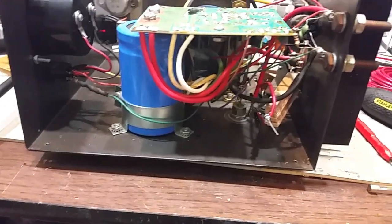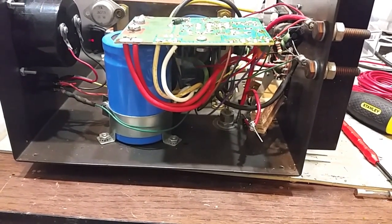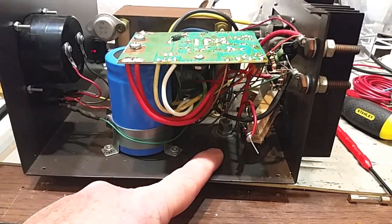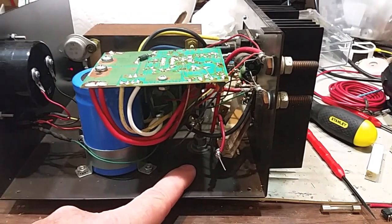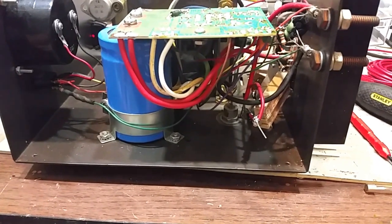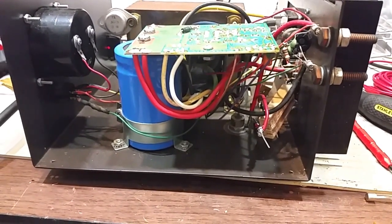The thing that bothers me is that if this was, in fact, at the repeater site where I think it came from, that means this thing sat there for maybe a couple of days, depending on that one little silicon-controlled rectifier to protect all the equipment connected to it. And if that SCR had failed, or if the crowbar had failed to trigger, you would have seen an overvoltage and could have destroyed a lot of fairly expensive equipment. The purpose of the crowbar is to draw high current and hopefully trigger some kind of upstream protective device — not to provide a short current for a prolonged period of time, which this one did.